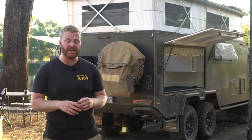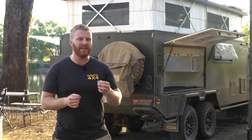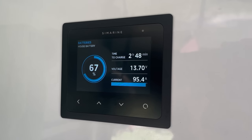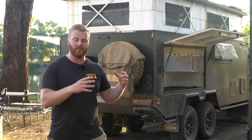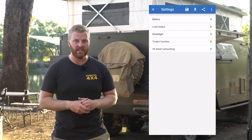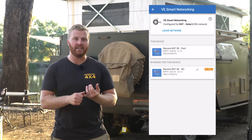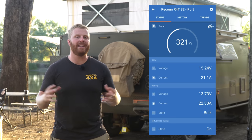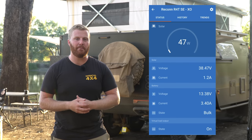This solar system has just worked perfectly for our needs. In fact, I can bring in over 100 amps of solar input at any one time — personally I've seen 103.5 at its absolute maximum, and I've recorded the mid to high 90s, which is still just incredible in really good solar conditions. Because we're using all of the Victron gear together, these devices can talk to each other, so I've set up a local network for the solar MPPT chargers to share data like the battery voltages, solar input voltages, temperatures, and amperage coming in from each array. It combines this knowledge together to provide the best charging profile for the lithium battery bank.